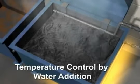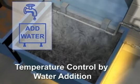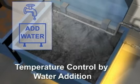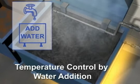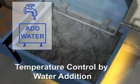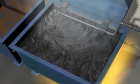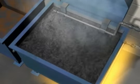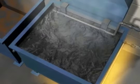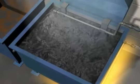The boiling temperature is lowered by adding back the water that was lost due to evaporation, while the heat or flame level is held constant. Only add water when the solution is boiling. Trickle the water in above the surface. Water addition mixes in with the boiling salt solution, lowering the temperature. If the boil stops, then the fresh water can't mix, and you must wait for the boil to return to continue adding water. A non-boiling tank will cause water to layer. The water layer converts to steam and the tank erupts from the expansion of the steam. Add water slowly to avoid layering and only when boiling.